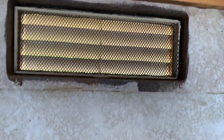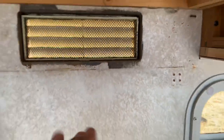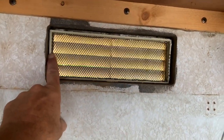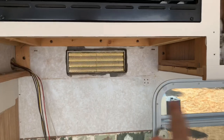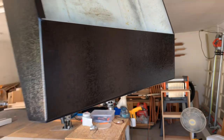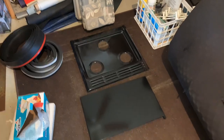Just push the screen box into place and bend the edges so they're flush with the plastic vent box. You don't have to do it this way — with the kitchen vent taken out, you can just remove the vent cover from the outside, cut your piece of screen, lay it inside, and reinstall the cover. But since I had the exhaust vent out, I figured I'd do it from the inside. That should help keep the mud daubers, wasps, and bugs out.